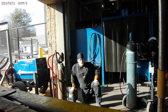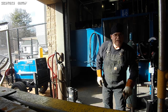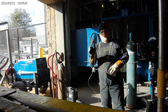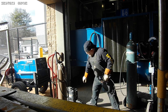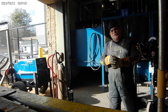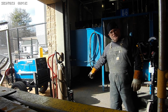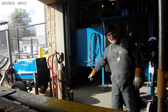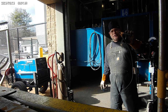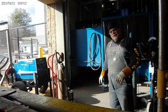What makes it a voltage sensing wire feeder is this. This is not a ground, even though it looks like a ground. What it does is it allows the wire feeder to sense the voltage in a remote location. As you can see, it comes on when the sensor is contacted to a grounding surface and goes off when it's disconnected.